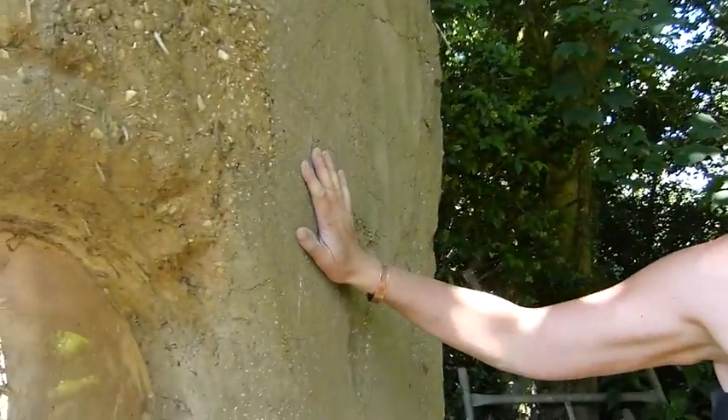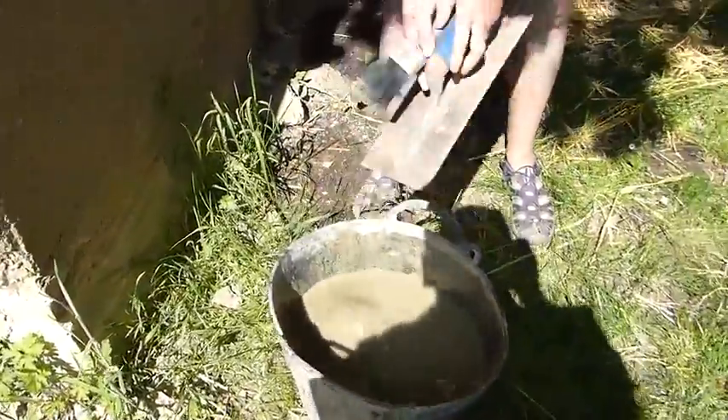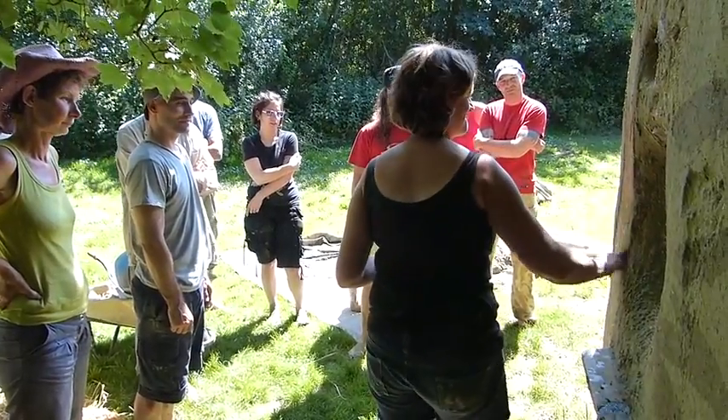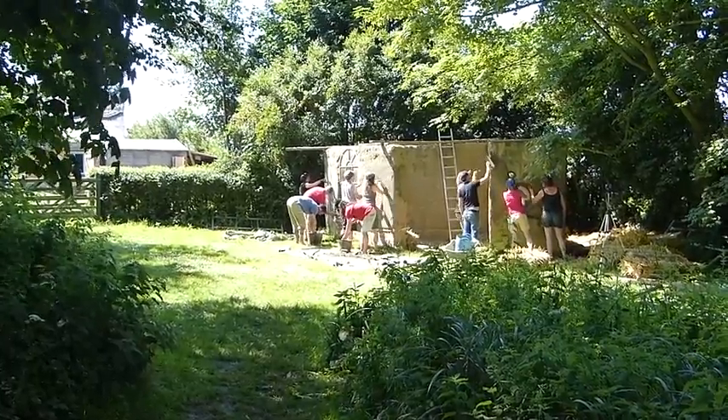You have made your clay plaster — it is beautiful, it is gorgeous — and we're going to put it on the wall. Now you'd normally put it on the inside, but we're going to be doing it on the outside just for practice. This is a typical wall; you'd obviously try and get it as straight as you can before you plaster it. The first thing you do is wet it down — if you don't, it'll just suck too much moisture from the plaster, then it'll crack off and dry too quickly. The reason we spent so long fiddling with our mix was to get the perfect mix, because that is literally half the battle.